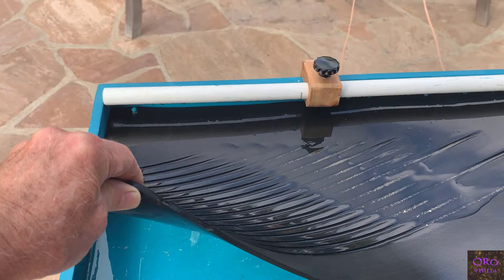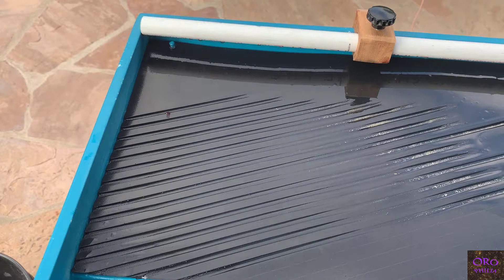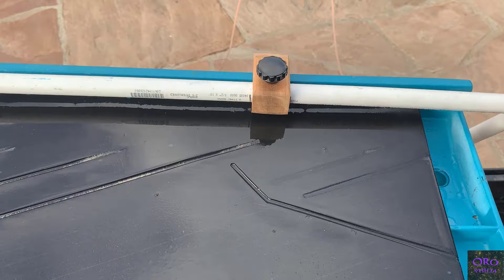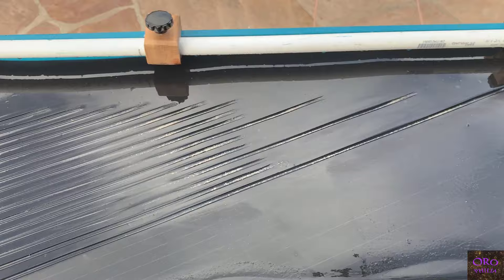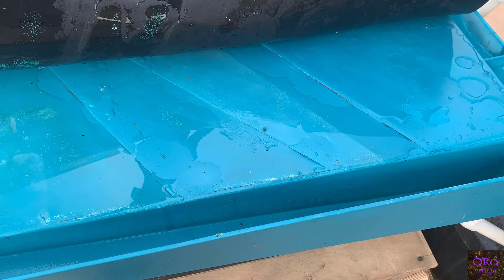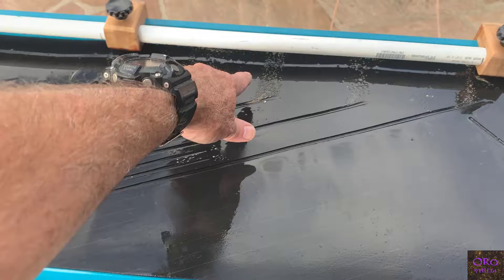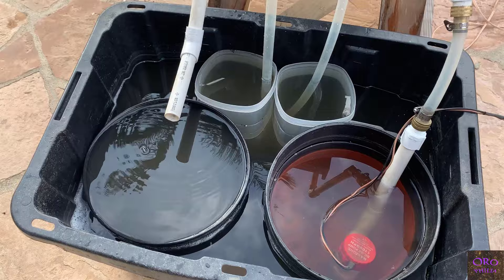The top of the table is a sheet of neoprene rubber, a quarter of an inch thick, and I've used a hand router to machine in grooves. I've made a number of these for testing different ideas — this one is working quite well so we'll use it today. Underneath is just painted plywood. You can see there are three steps in the table; each step is an eighth of an inch high, placed in a particular way to reject material in stages as it comes down.